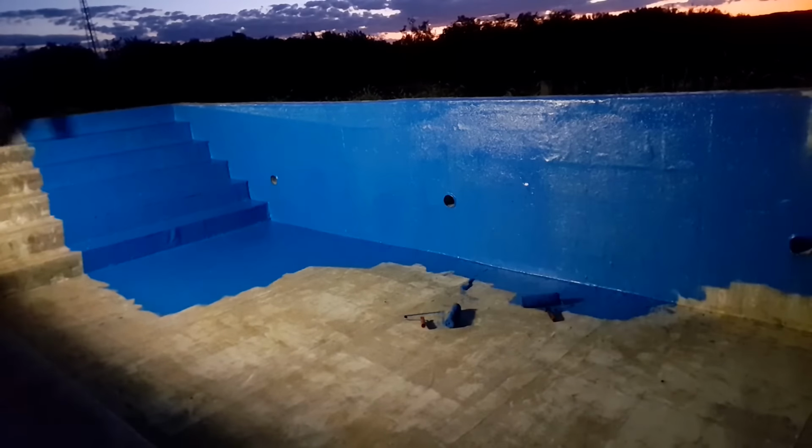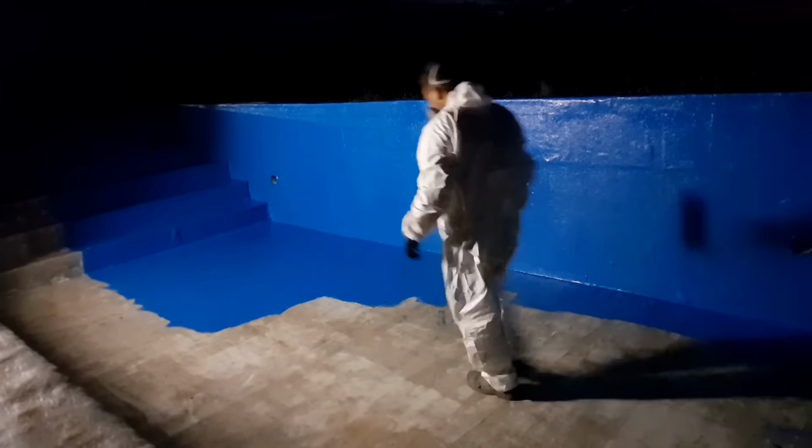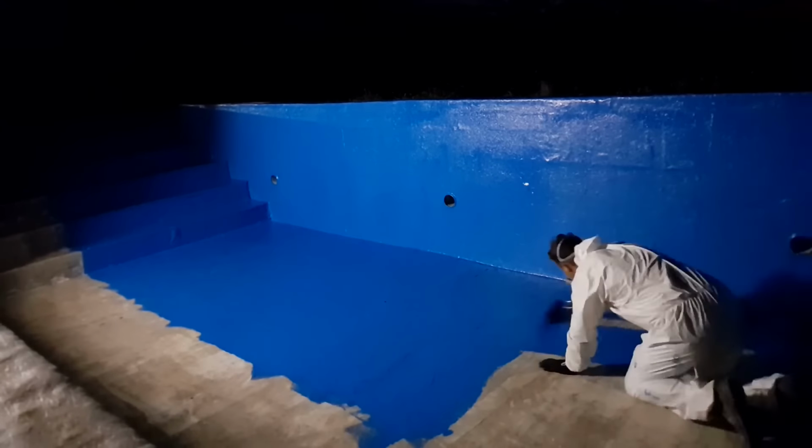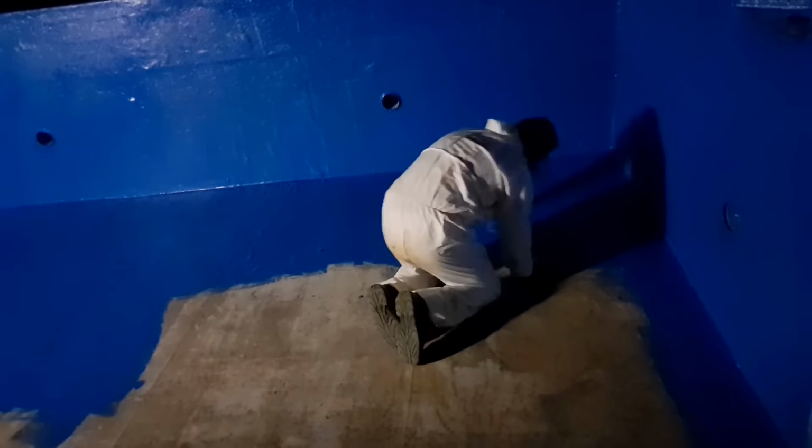Just like the resin, it is very reactive with the weather and the sunlight. It sets almost as fast as the resin. I used up like 15 paint rolls just to get the 2 layers done. The paint in these rolls sets because the rolling motion generates enough heat to do so. So I was able to use a roll for 20 minutes until it turned rock solid. I tried to work with it during the day, but it set instantly. That's how hard this stuff is to work with.